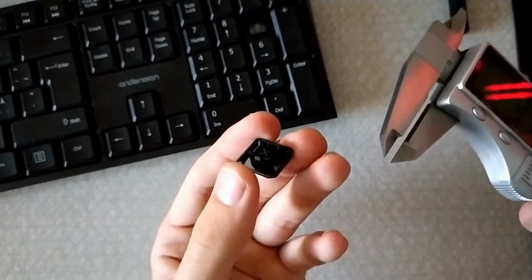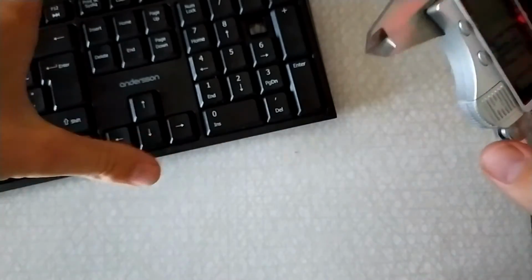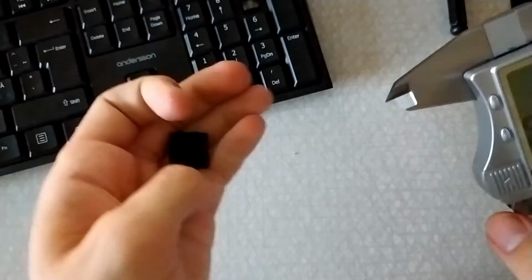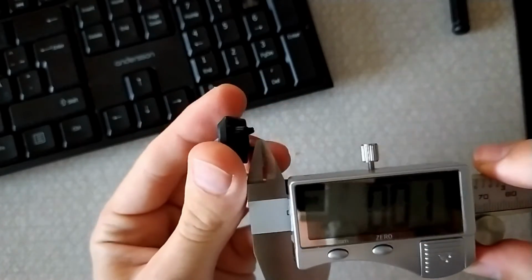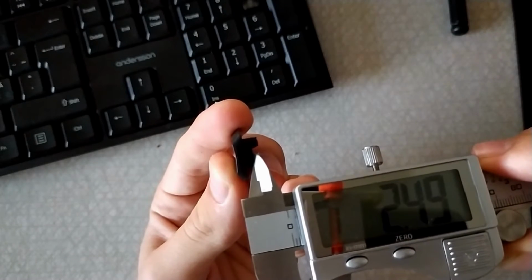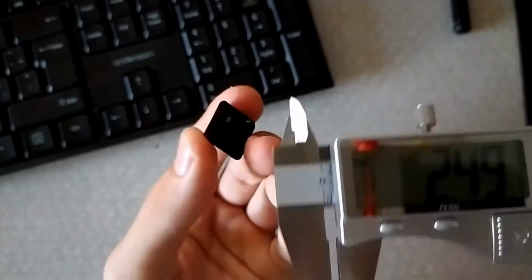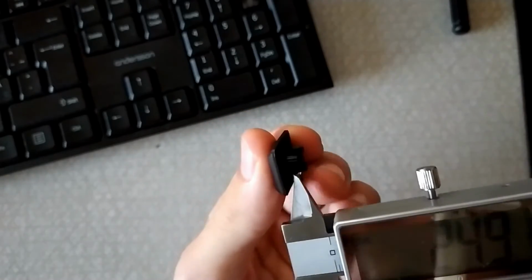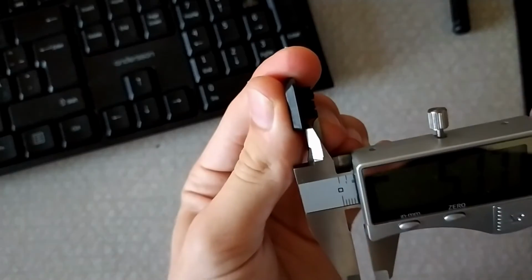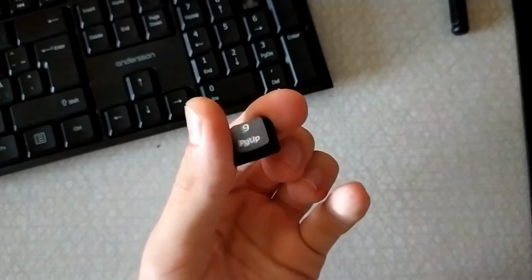So that will actually be slightly less than 2 millimeters thick, and then we only have this part in the center, which actually presses the little plastic piece you see here in the center right there, and that should go in 2.5 millimeters inside this, so that's slightly lower, and this part that sticks out is actually 5 millimeters further out than the actual tab. So now we'll take those measurements and go into Fusion 360.